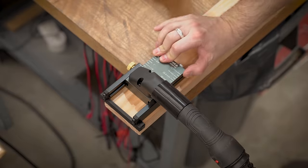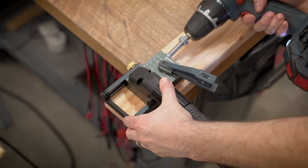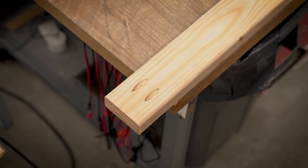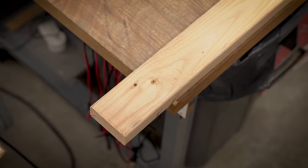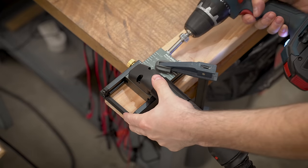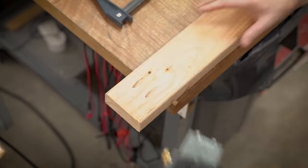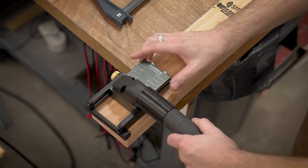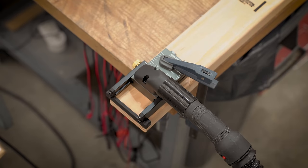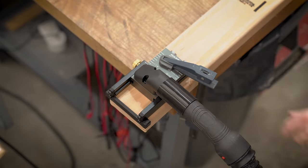The hole locations are not that critical on these vertical pieces. As long as you get two in one end and two on the other end, you're totally fine — they don't even need to be on the same face. I'm really liking this little pocket hole jig. The dust collection is actually fantastic — I have this hooked up to my little cordless Bosch vacuum and there are basically no chips, which is really cool. I do need to make some little tweaks on this 3D-printed bracket — I'll release that on Printables. I'm going to make a whole bunch of little attachments and modifications for it.